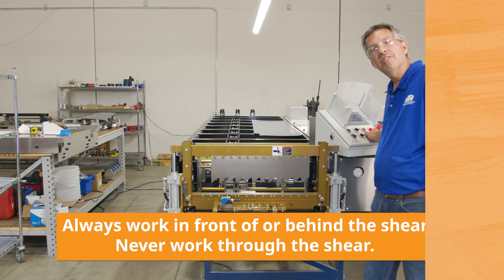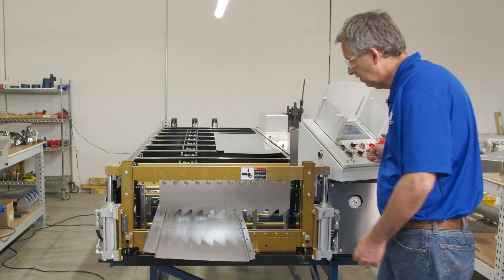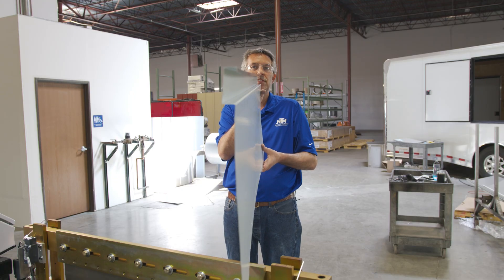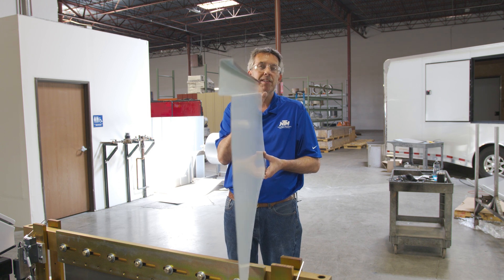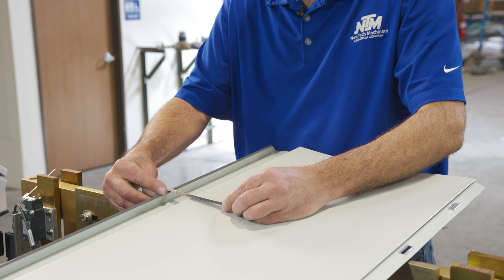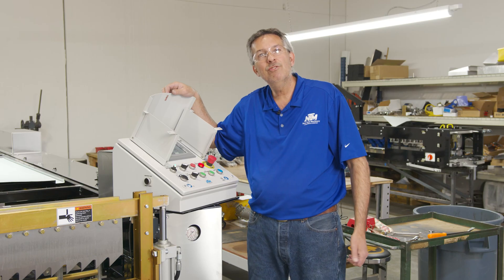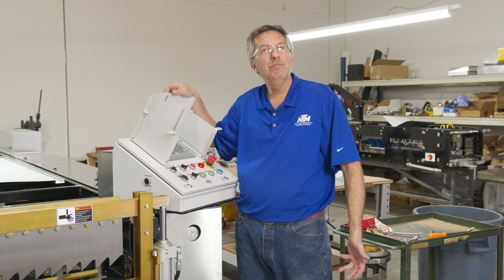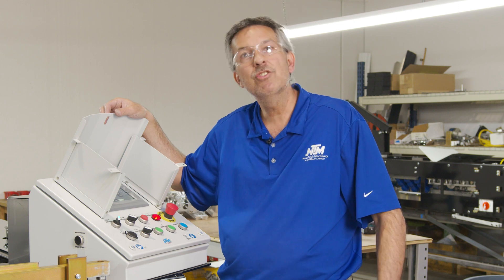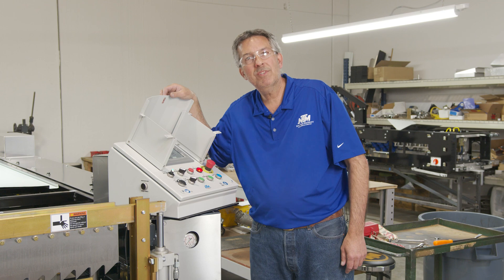Now I've got my six-foot piece in the entry guide — let's run a piece through and see what we got. Looking at the panel, our outside leg ran straight. Now let's measure our little leg to make sure it's 5-16ths that slides into the male side. As we put the scale on the edge, we measure 5-16ths, so we achieve the goal. This concludes our video on adjusting for uphill-downhill and making it dimensionally correct. Stay tuned to the next video on installing and adjusting the shear dies. Thanks for watching and we'll catch you on the next video.